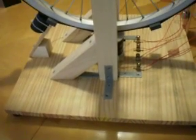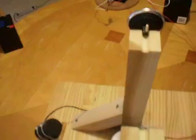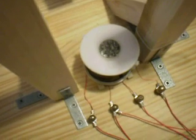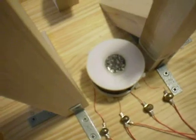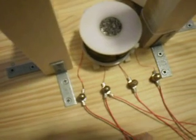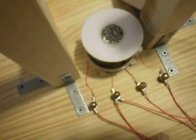The frame is made of poplar and pine — a little overbuilt because I've used it for other things and adapted it later to this purpose. The wheel merely rests in these grooves and can be easily removed so that you can do other experiments. Here you see the coil and the core, which is made up of slender steel rods packed in tightly, with four outlets: the two 24-gauge outlets and the two 20-gauge outlets.